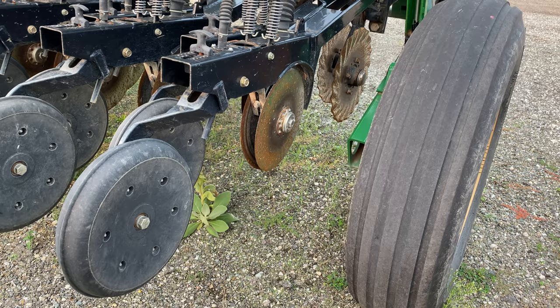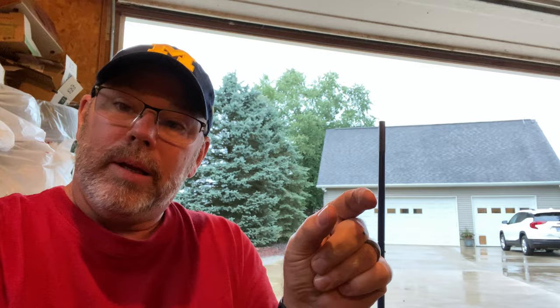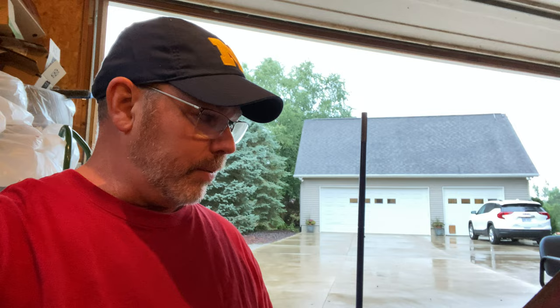With a grain drill like this, some have what's called a press wheel, but not many. Behind the disc, after it opens that seed channel up and drops the seed in, this one has nothing else — it just leaves it open. I've had turkeys out there within half an hour picking the seeds out of those trenches. I would rather have press wheels, but it's a numbers game and I'm just planting food plots for turkeys and deer. Some do have a press wheel that comes behind and pushes down on the trench to close it, but most just leave it open and hope rain and wind closes it. And there you go — great seed-to-soil contact.